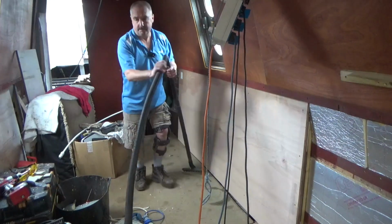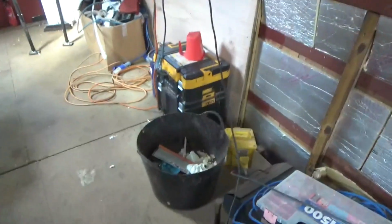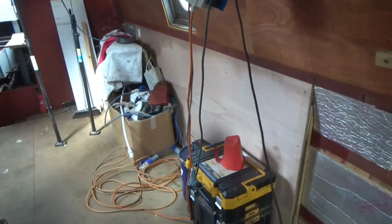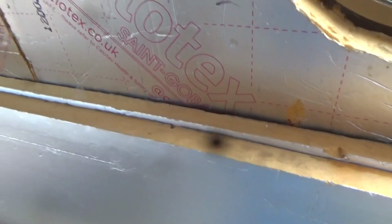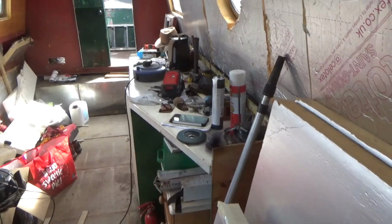That, we'll just give it a hoover up. Just put stuff back to that side, so that board's on, and I've run out of the material now for the packers, so we're on up this side. Up to there, which is like here, so I'll just have a measure up for the rest of the boards up there and for the other side. I'll rip them all down with 10mm clearance in the workshop, put them on the wagon and bring them up here.